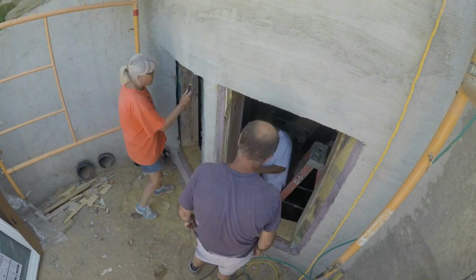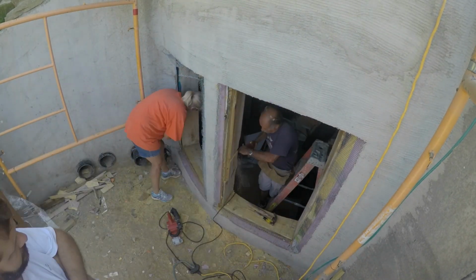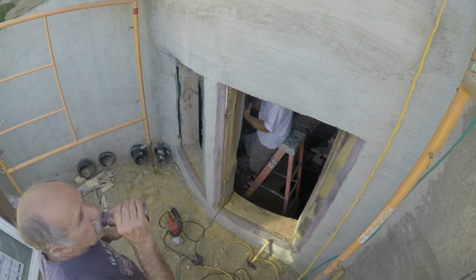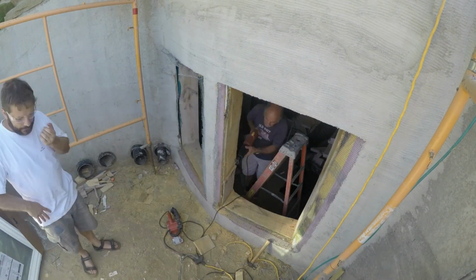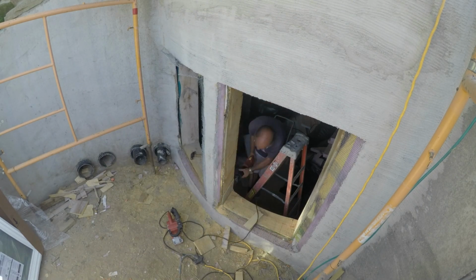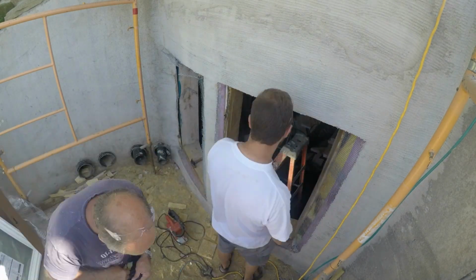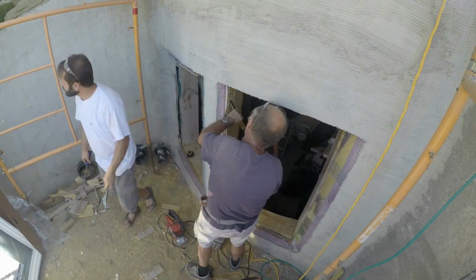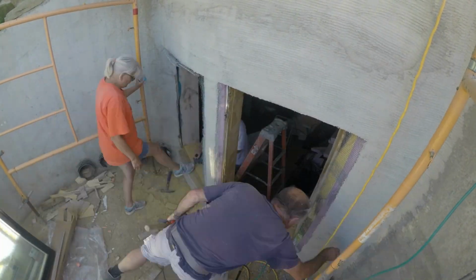These basement windows did not go in easily. The bucks had racked and some even bowed in or twisted a little under the load of the shotcrete around them. And with me starting such tight tolerances, I then needed to trim them back before I could even get the windows to fit. Rather than muck about with millimeters, we just cut out 3/4 of an inch, more off the top than the bottom because that's what it took to make it square again. Then we sanded the buck all smooth, so that tape would seal nicely against it, and then we tried fitting the windows again.